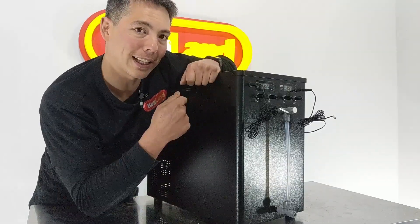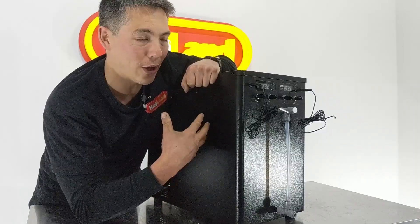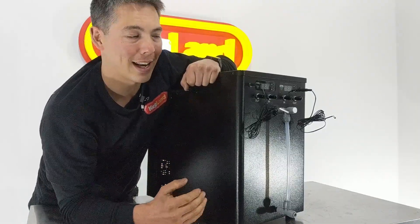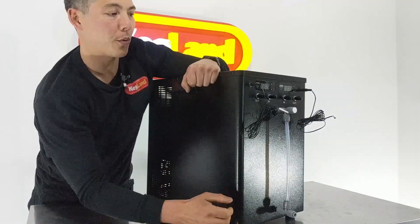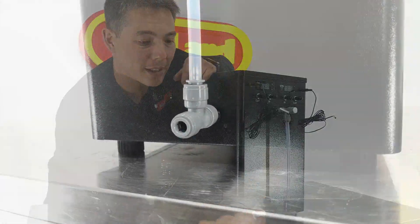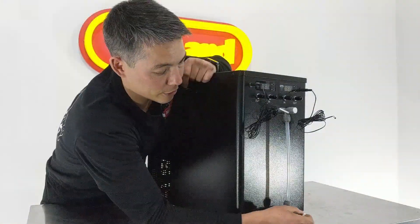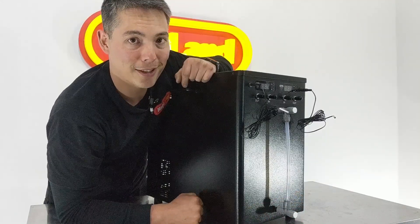Some people who are frequently connecting or disconnecting hoses might lose a bit of glycol each time and not know how much was left — it was hard to check. Now it's really easy. To connect a hose, you just remove the bungs — these bungs come included with the unit — and you can put a hose in there to an external pump, or if you're not using it just drop the bung straight back in.